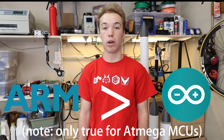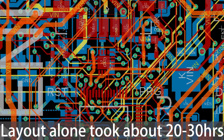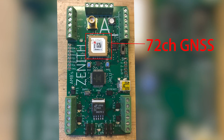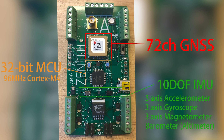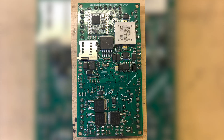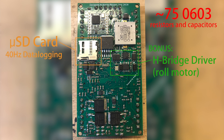I have experience with Arduino from previous projects, but I decided on the Teensy line of microcontrollers because of their ARM processor, which runs faster. For the purposes of space and volume, I decided to make a fully custom PCB designed in Eagle, which came with its own routing challenges, especially as it was four-layer. The main components are GPS, microcontroller and bootloader chip, sensor cluster, and N-channel MOSFETs for the pyro system. On the back, there's most of the passive components, as well as the SD card slot for data logging.